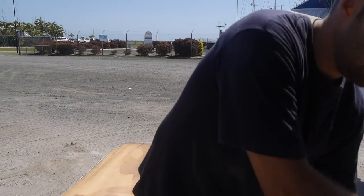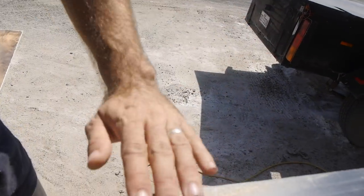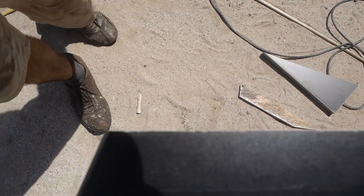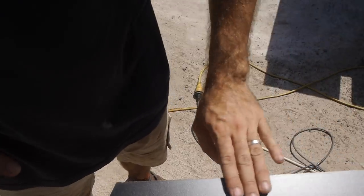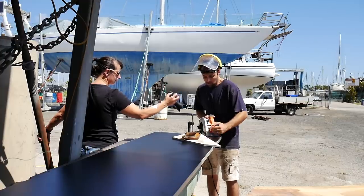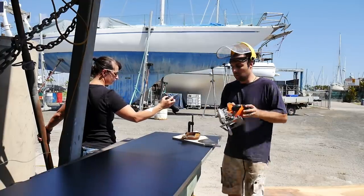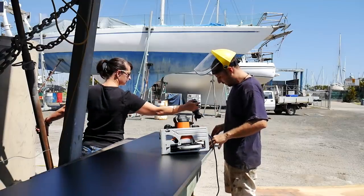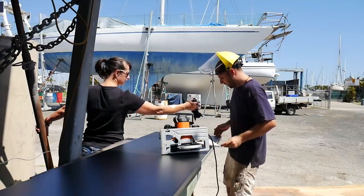So I was cutting it really, really slow then, because as the blade goes up, it chips the melamine surface. So I wanted to keep it as neat and tidy as I could, really. You basically line it up with the edge of your saw, so that as you move along, you press against the wood, but you can't physically go in past the wood, if that makes sense. So it holds it really, really straight. You end up with a really beautiful cut all the way down.